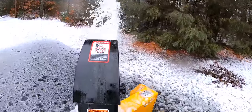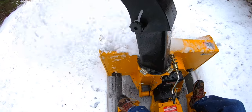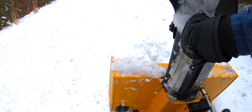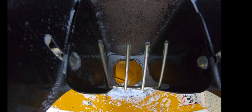Everything was going great until right up here. I'm going up a hill and pushing it, but you can see the snow wasn't going into the machine very well — and then everything froze in that chute completely solid. Now every snowfall is different, so I can't just say the Walker snow blower is terrible, but I think part of it is a design defect. It's this guard right here — these little forks can catch on snow, and with a really wet snow like I've got, they built up enough that the guard was making the chute clog. So it's your decision on your own machine, but for me I cut this guard right off and pulled it out of there.